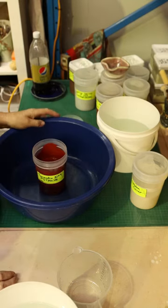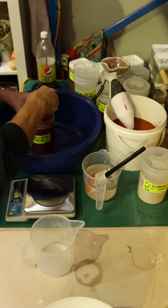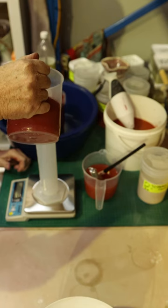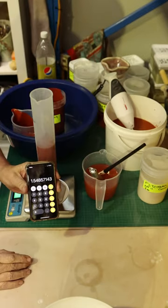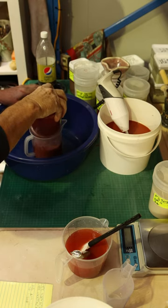We've just made this to move the glaze up. Once we've done the SG, we're going to dip some test tiles. Let's give it a whisk. Pop that down and zero it. Pour around about 350 ml in. So that's an SG of around about 1.54, which is a bit high. That's got 80 ml of water been added.